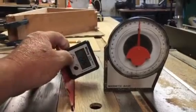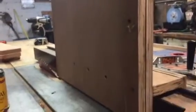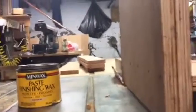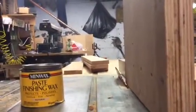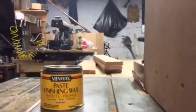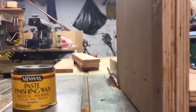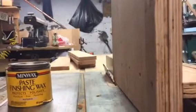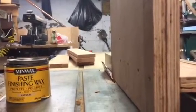What I'm doing is I built this jig — it's a jig that slides along my fence so that I can cut straights or angles. What the saw blade is set for right now is around 22 and a half degrees, because I've got to do some angle cutting on the wood. I'm gonna do some experimenting now with some other pieces of wood, and once I figure it all out, we're gonna go for it.